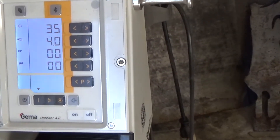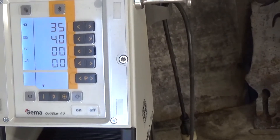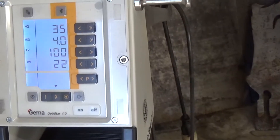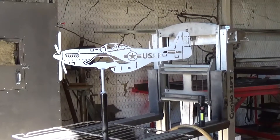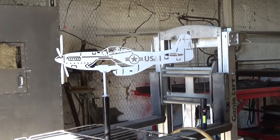You can see the UA — which is the microamps — is at 100. I'll press out again, you can see it's 100; that's the bottom number. Once we go to the Faraday cage area, which is this symbol right here, you can see the microamps are only 22. So that doesn't put as much electricity into the part. Now we'll go ahead and shoot this flat piece to see how it works with the 100 microamps, and then switch to 22 microamps to show you the Faraday cage solution.